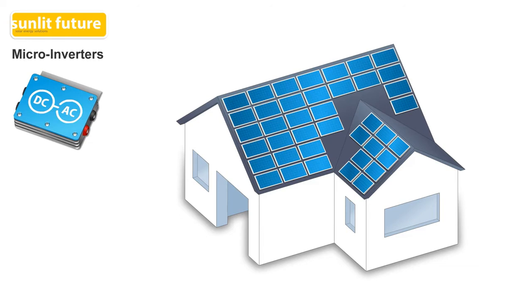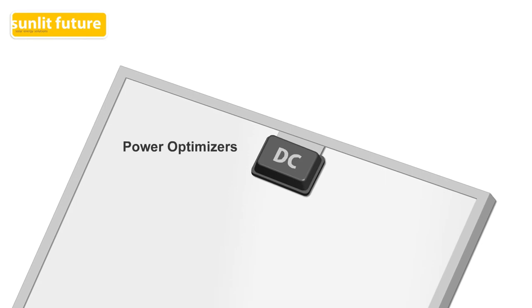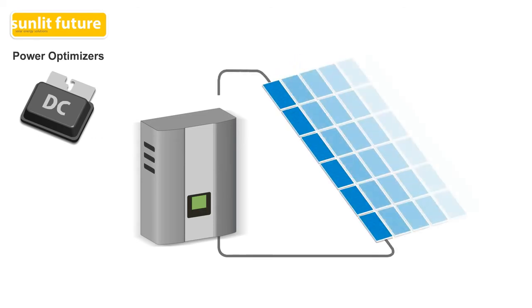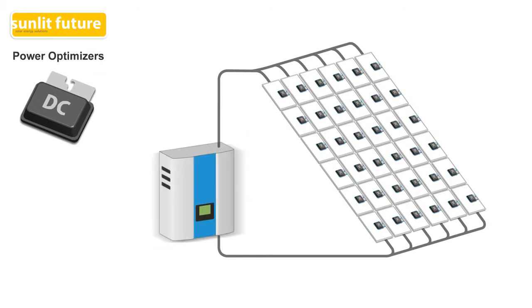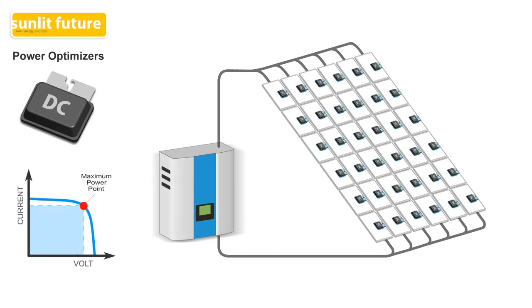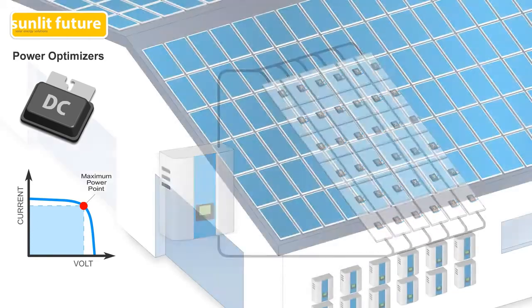Microinverters are rapidly gaining popularity, particularly for residential solar systems, but they are far more expensive than systems with regular string inverters. When DC power optimizers were introduced, they became a more affordable option. This system splits the traditional inverter in two products: a power optimizer and a simplified inverter. The power optimizers are located under each panel, turning them into intelligent modules. By using panel-level tracking and real-time adjustments of current and voltage, the power optimizers maximize system output to the optimal working point of each panel.